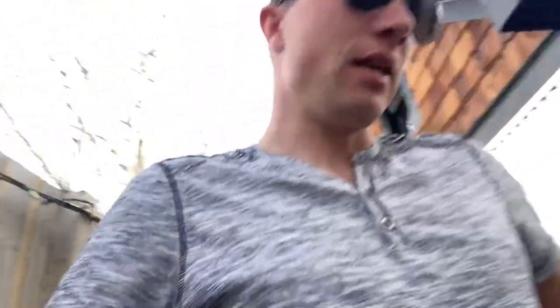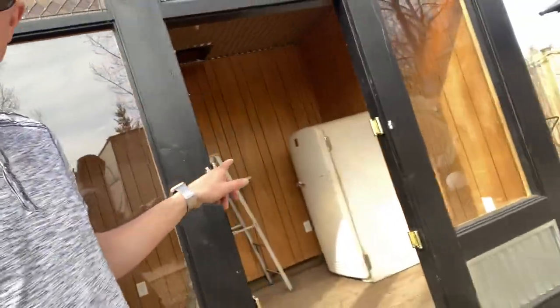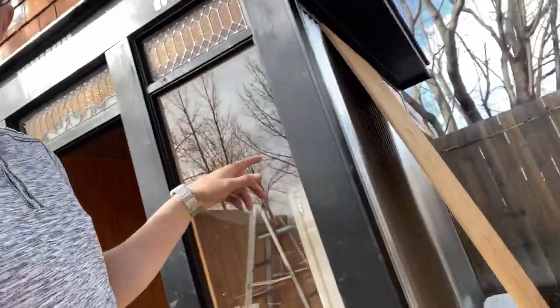I'll start right here in the middle of the opening, get it stained and painted, and the front all painted up. I did take the saloon doors off because they're kind of scuffed up and the paint is sort of thin on them. I'm going to attempt to sand them down and stain them, but the louvers in there are going to be pretty hard to sand, so it might just be a matter of sanding the edges and then painting the louvers black — which would look all right and match a bit better. So what I'm going to do now is cut the storm door to fit; I think my measurement was 74 and three-quarter but I'll double check that.